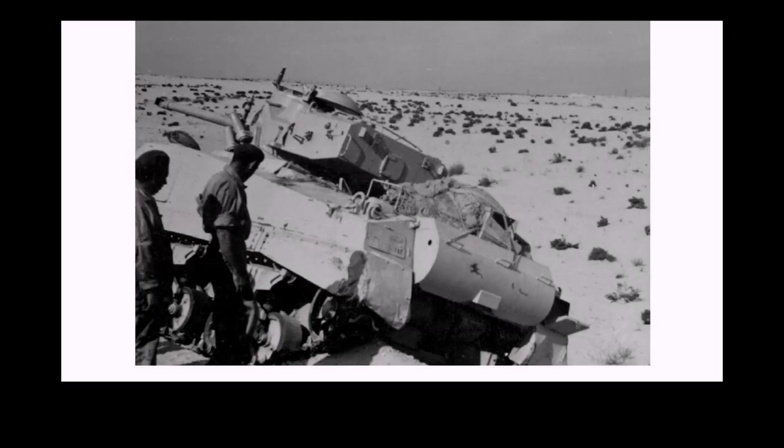There is a lot of photographic evidence showing the capture of some M4A4 FL-10s by the Israelis, along with about 50 T-34-85s — in other words, all the Shermans at El Arish and Rafah not destroyed, and other vehicles. Some sources claim that as many as 8 of the 12 M4A4 FL-10s were captured intact. All captured Egyptian Shermans were converted to the Israeli standard, even some of the 8 M4A4 FL-10s. These received a suitably modified standard Sherman turret in place of the FL-10 turret. They were probably later upgraded to the Degem Bet, or Model B, standard in the early 1960s, receiving a new Cummins VT8-460 turbo diesel delivering 460 horsepower and horizontal volute spring suspension system, remaining in service with the IDF until 1975.